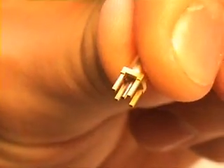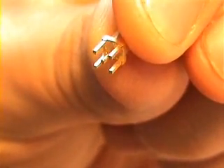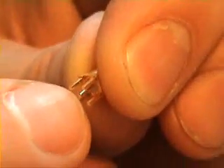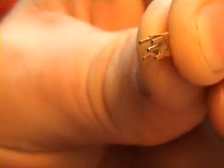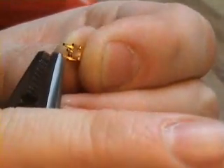The next stage is to drill out three holes on the Bluetooth dongle to take this MMCX PCB mounted antenna socket. We're going to first break off two of these legs, because there isn't room for all four of these outer legs. I'll break two off so we have the centre one and two outers. I'm going to do that using a pair of pliers.